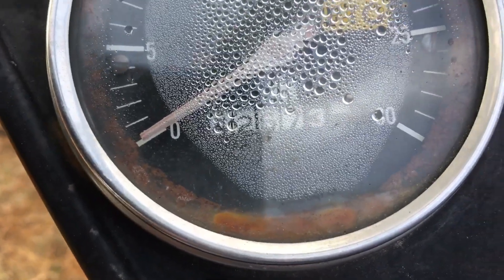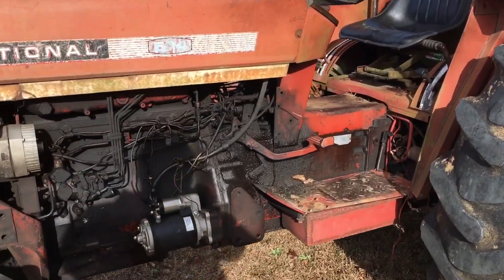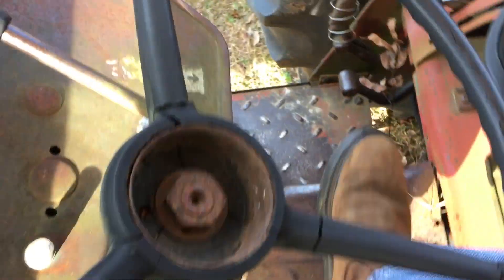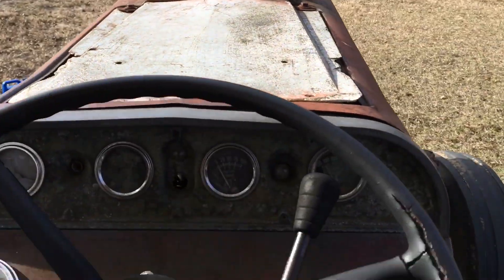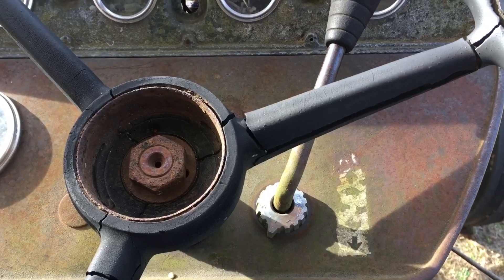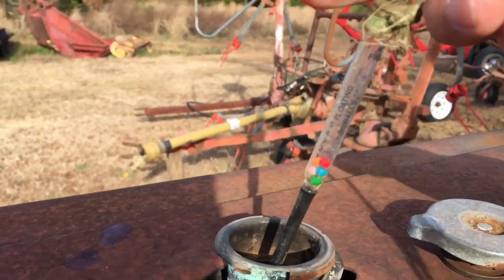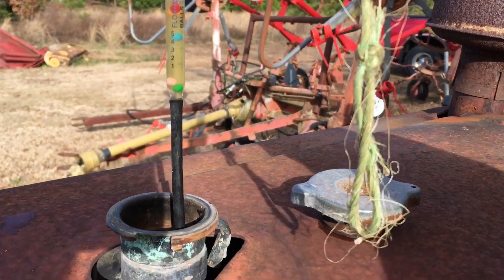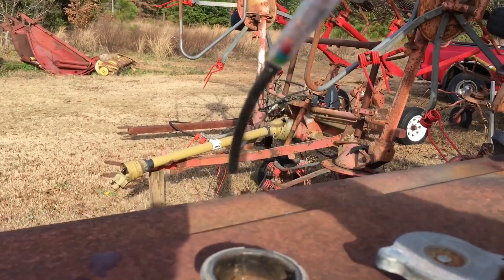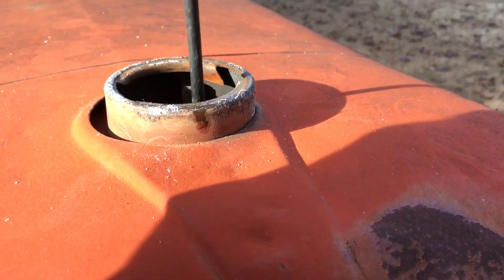Alright, let's start my 574 up and let it run for a few minutes. Check the antifreeze in my 574 — it's gonna float three balls, which will be negative 10. We might add a little more to it. I don't think we've got any danger of getting to minus 10, but let's check the antifreeze and see what it's looking like.